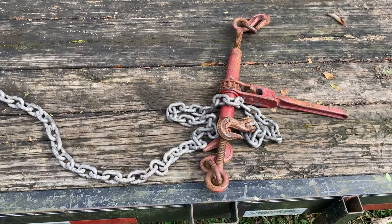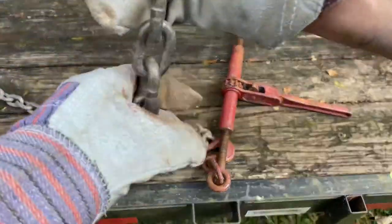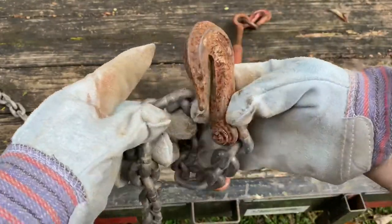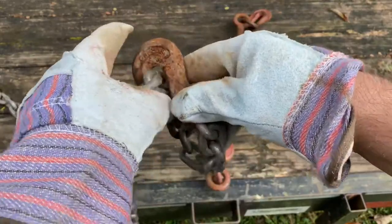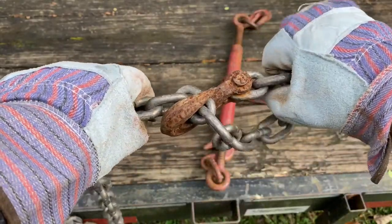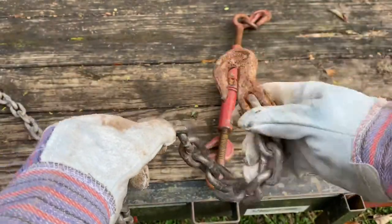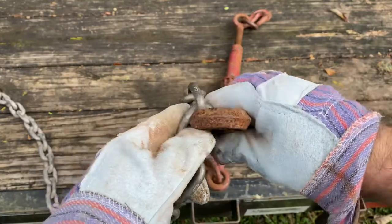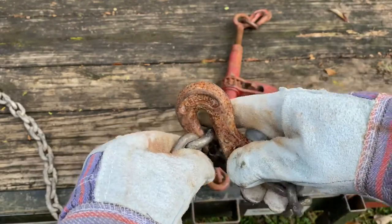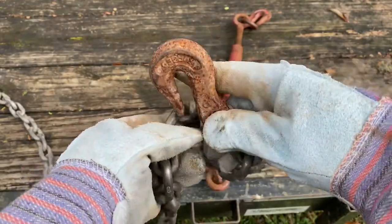These are two common things you'll find when working with chain: obviously a piece of chain, then you've got a ratchet binder and a grab hook. One of the first things I noticed the first time I saw a chain and a grab hook was that it didn't seem to work well together. If you take the grab hook and the chain, it doesn't really fit the way you might think. The way a grab hook works is not to go into the chain link — it actually goes in and gets across the whole link, so it pulls tight against the next link. I've seen a lot of people try to connect it the wrong way, and when I first started working with chain I tried that too. Do not connect it that way, because when it gets under a load it'll actually bend or break that hook.